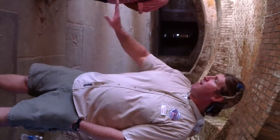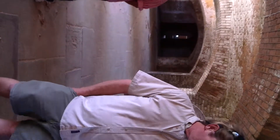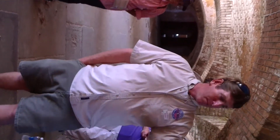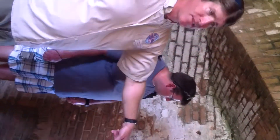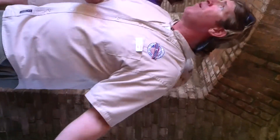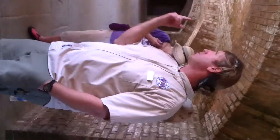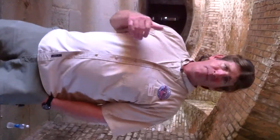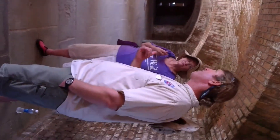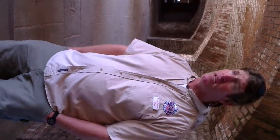The slate on the floor does a good job at providing a semi-smooth surface for the gun mounts. You also have granite — there's a piece of granite here that acts as a lintel underneath all the embrasures. How that works is the carriage has what's called a tongue or extension that goes underneath that granite, pinned at the same distance back in the wall as the embrasure to provide the correct pivot point for the cannon. The stairwells are all granite too, and it's impressive because the vast majority of this granite was cut at the quarries to fit and just put in place out here. When you look at the tolerances, that really is amazing craftsmanship.